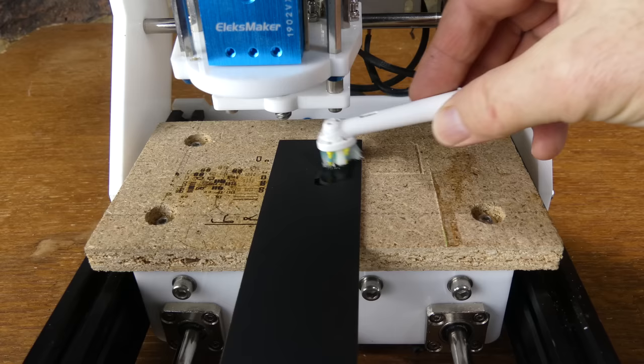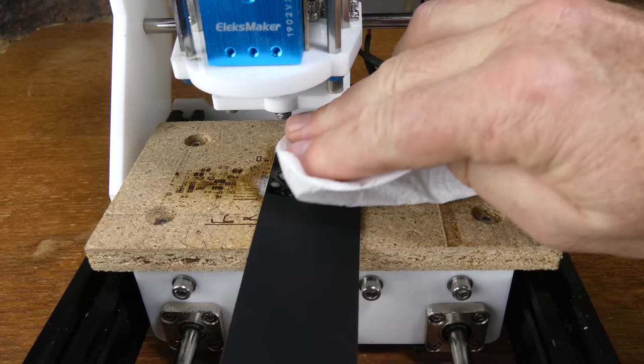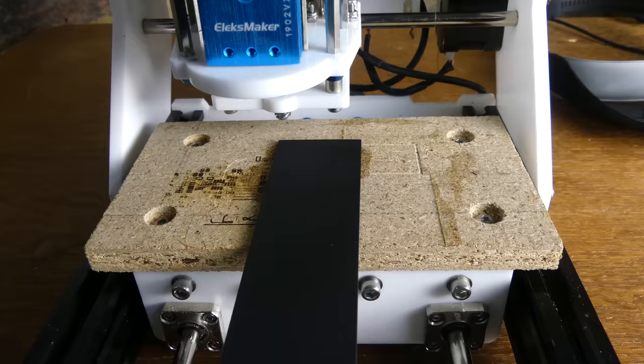It does leave a residue, which I clean away with a soft toothbrush and washing up detergent. The paint layer is surprisingly tough, so you can give it a good scrub. I repeat the process two more times to get rid of the paint residue.